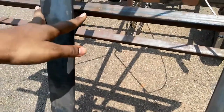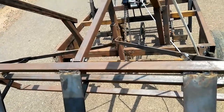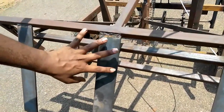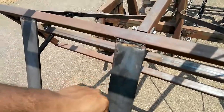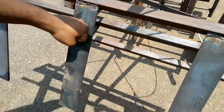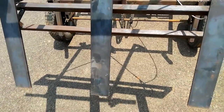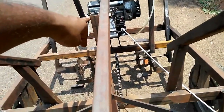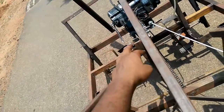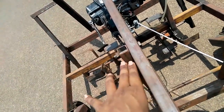The rake angle we have chosen is about 45 degrees. The reason for the 45-degree rake angle is that after 60 degrees the draft requirement — meaning the power requirement — gets increased. The narrow tillage tool can be engaged using this setup. We have used bolt and nut and created drills on this side so that the narrow tillage tool can be grounded and engaged with the ground.